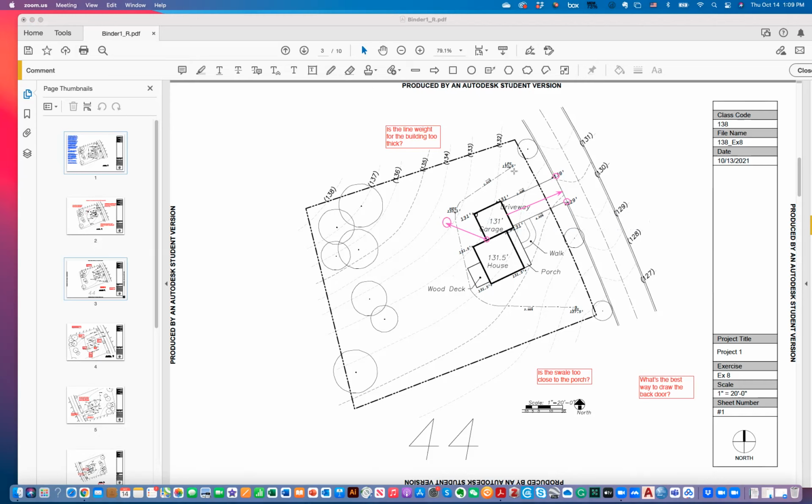And then your LPS would be, yes, around this area. Your LPS could be around in this area, which means that will be 131.5, and this one would be 130.5. And then based on that, you could start to kind of draft a swale center line and then continue the calculation, verifying that both swales will be within that slope range, okay? Yeah, start from the driveway and feel free to start that calculation right now and then maybe we can revisit it at the end of the review, okay? All right.